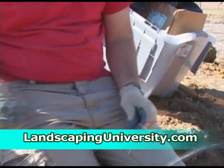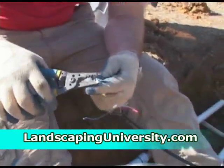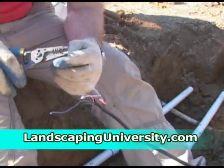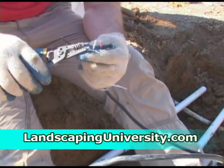Red, white, and blue will be my hot, and I'm using my black wire as the common wire. Give each valve a little bit of working room — I've got about five inches. Then just use a pair of electrical pliers and strip your wires about a half inch on each wire.